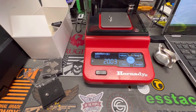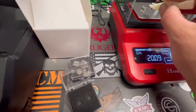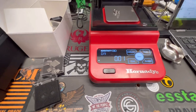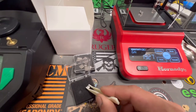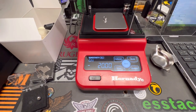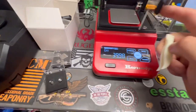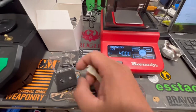With the windscreen closed, it's reading 20.03 to 20.06 — that's pretty good. If we add the second one, we're at 40.09. Let's zero it out and take them off. Pretty accurate. It says we took a 20 off — look at that. Grab the last one — it says we took 40 off. That's pretty impressive.